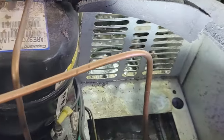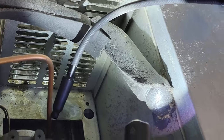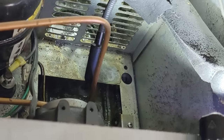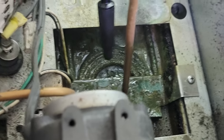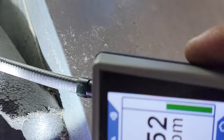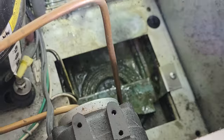Now for those who watched my Mitsubishi video — I don't have a $50 leak detector. We can get down here close and it'll go for a thousand parts per million. It's hanging there at 900. If we go down lower in the actual area, look how much higher we are. That's the reason why I know whether it's a real leak or a flare leak. So we're chopping that thing out.